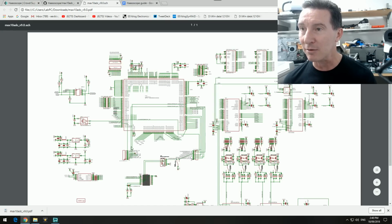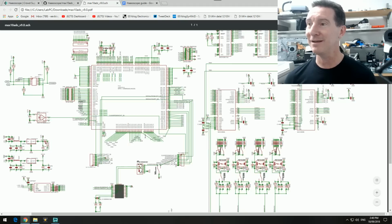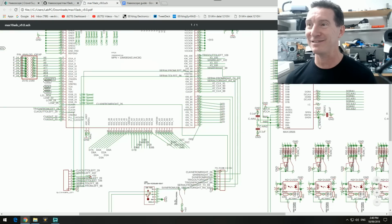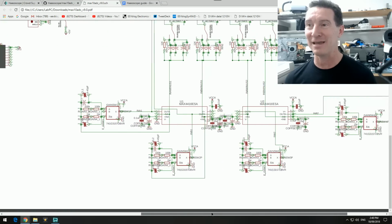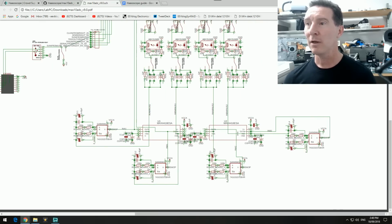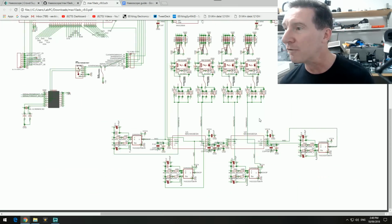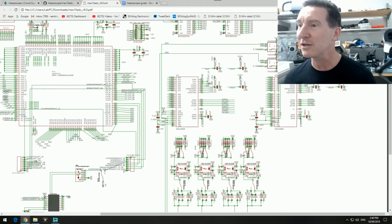Geez, look, they've got lines going through the FPGA. What's going on? I'm sorry, but what is that? Do we have a formatting problem, or is that how the schematic was? That's a pretty horrible looking schematic, I must say. Wow, what's gone wrong there? That's got to be a formatting issue with the PDF. Anyway, that's terrible. That needs to be completely tidied up. That makes absolutely no sense whatsoever. There's no flow to that. There's no traditional left-right flow for your signal inputs or anything.